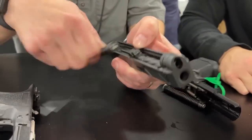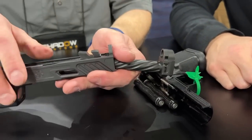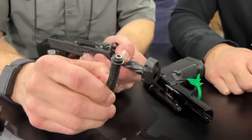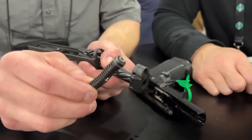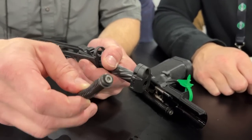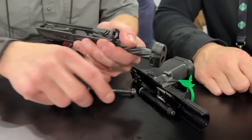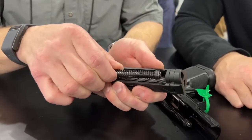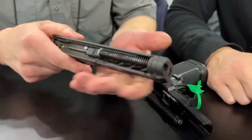On the CR920P, we employed a detent basically right here to add redundancy to the attachment. On these models, we're actually using a modified guide rod. It's not a requirement — it's not going to open on its own — but this just adds the same kind of redundancy to the design that the original detent did on the CR920P. When the guide rod is installed, that screw protrudes a little bit into the locking lever and prevents it from being opened. It just adds the redundancy that we like to have in our designs.